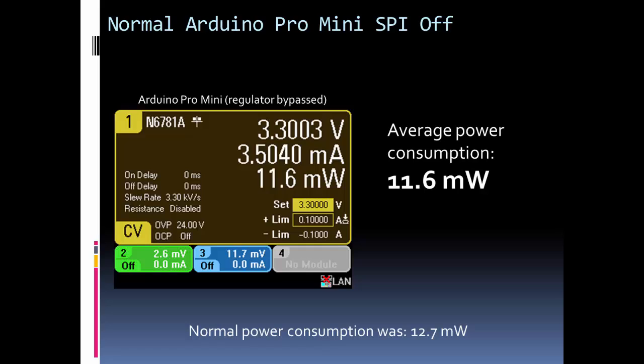If we turn the SPI interface off — with the ADC back on — we get about 1 milliwatt of power savings. As you can see, this is nowhere close to as much savings as sleep mode, but the benefit is we can still use the Arduino. And if it's functionality we don't need, then it makes sense to turn it off.